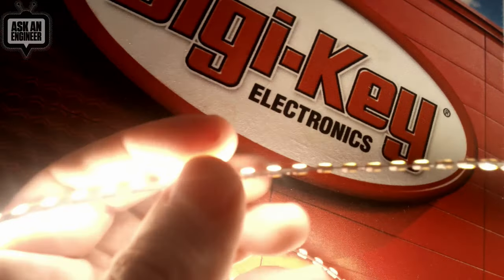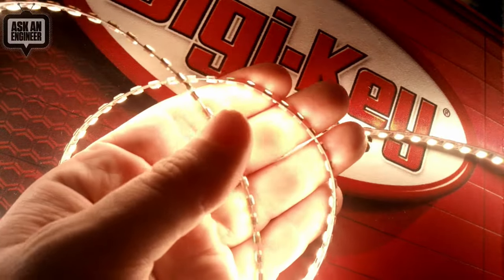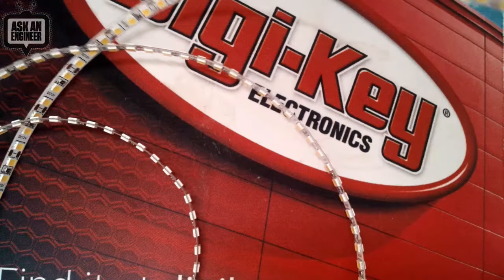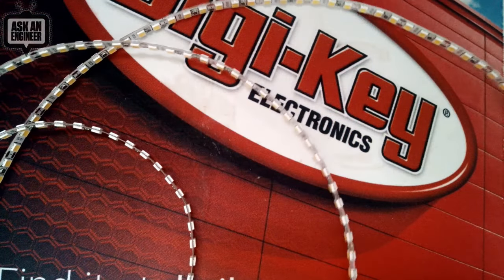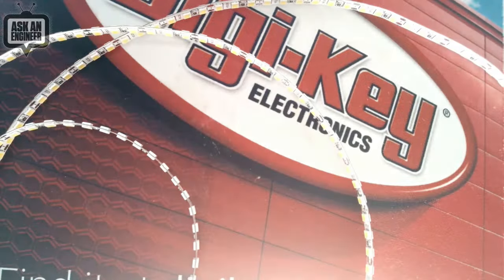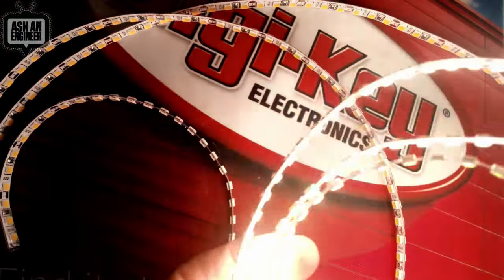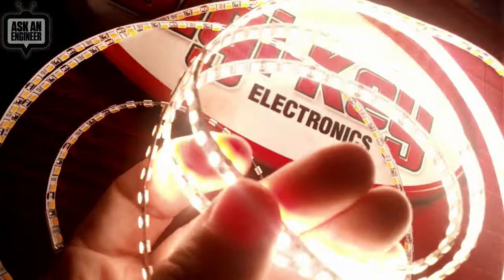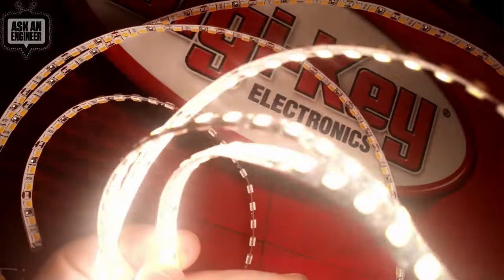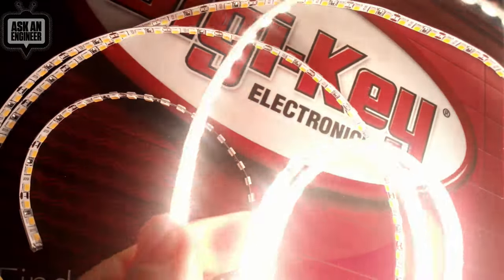They're great for illumination. They're very thin — only six millimeters wide by maybe three millimeters thick. This is the warm LED version on low at 9 volts — at 12 volts it draws about an amp. We have three color temperatures: 3000K warm, 4500K neutral, and 6000K cool white. So three different options depending on the look you want.